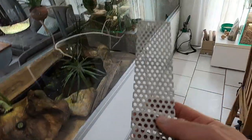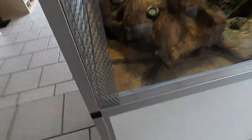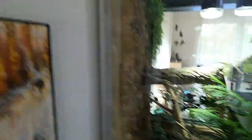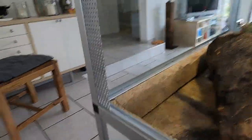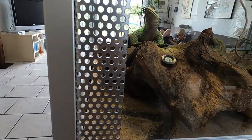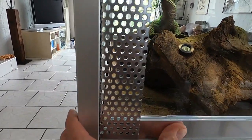And finally my last addition is made out of aluminum sheet — I angled it and built it on this side. I built one here and one over there. It's angled and screwed in. If you see here, you can close the glass door — it's really tight. And I can choose if I want to open it very wide, or in the wintertime I can close it and have a really small gap. In the summertime I can open it really wide, and the air can circulate through the whole enclosure from this side to the other side.